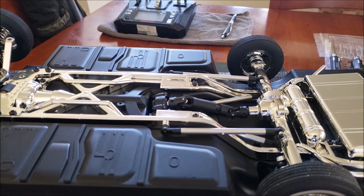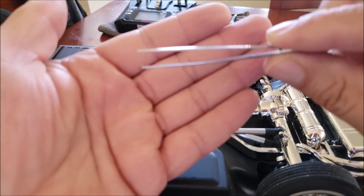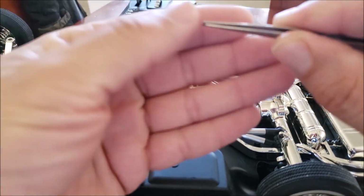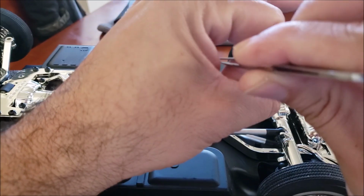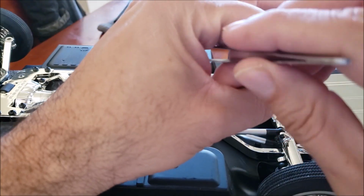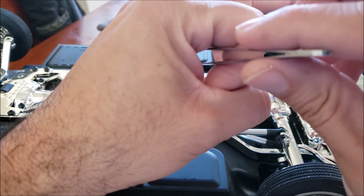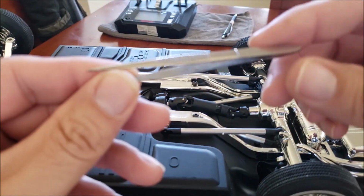The good thing to do if you want to take the bearings out is to just grab a pair of tweezers that'll fit inside the race of the bearing. Just stick this inside like this. You see the bearings like this, just stick this in and this will open up, and just push it down enough to where it has a little pressure, and then it'll pop right out. It's pretty simple, easy. You're not going to damage the bearings.